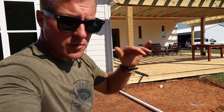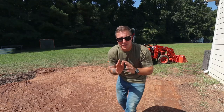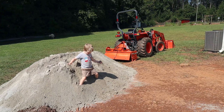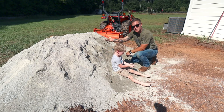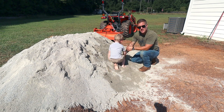I put a little bit of drop in it so the water runs off, and I'm going to put a little bit of drop in the whole entire patio going off into the yard as well. So this pipe is going to work perfect as a guide for our first two inches of sub-base that we have to pack in. Now we have to wait for gravel. I ordered four tons of M10. We're going to put down two layers, pack it down with a plate compactor, get it all level, fill in the holes as needed, and then we are ready for the flagstone.